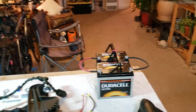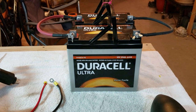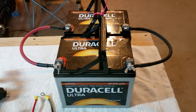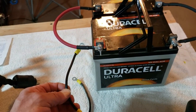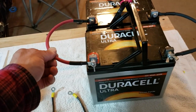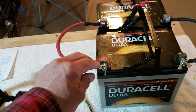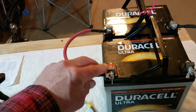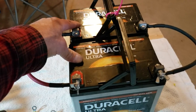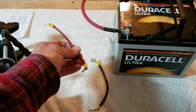Starting with the batteries — here's what I've been using: 12 volt 35 amp hour AGM deep cycle batteries. I run two of them in parallel just like this. Until now I've been using wires to jump the two batteries, and I had my local stereo store make me some heavy duty ones in 8 gauge wire. The ring terminals have quarter inch holes so they work with my hardware — much less resistance between the two batteries and much heavier duty. I was worried the old ones were going to break, so I wanted to improve that.